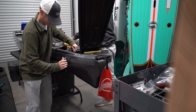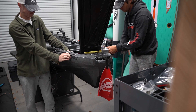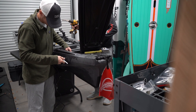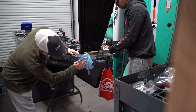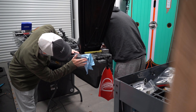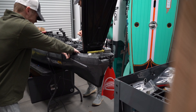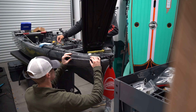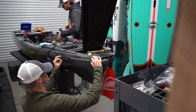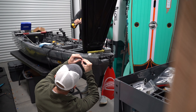These Yak Power lights are pretty slick to install — it's very similar to the button lights except you use a slightly bigger hole, a half-inch bit, and then you use the included allen key that comes with the light to cut the threads into the plastic of your boat. Once it's installed, all you have to do is plug the light in. We're cleaning the hole with acetone so the adhesive on the back of the light will grab a little bit better. Then just plug the light in, pull the adhesive backing off, make sure everything's level, and install a small screw on the front to make sure it has a permanent install on the boat.